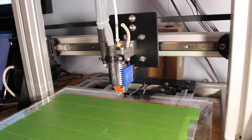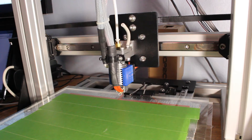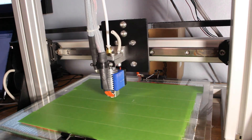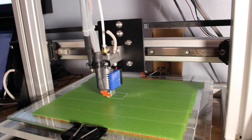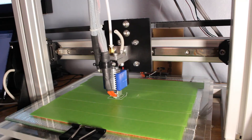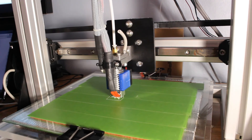So I've had some trouble with homing with G-92. I've got it moved to the back now, thinking maybe this axis may need to invert it or something. I've only printed that one cube so I couldn't tell if it was backwards - I need to give that some more thought. The bed's supposedly heating up right now but it's having trouble getting quite to 60, so I'm going to crank the voltage a little bit - give it just a little bit more. I haven't run this hot end fan at 24 volts and I don't think it'd like it, so I'm at about 14 volts now. The bed's at temp, the hot end's at temp, it should go. 60 degrees is not sticking so good, so I'm going to go ahead and stop this and try again.